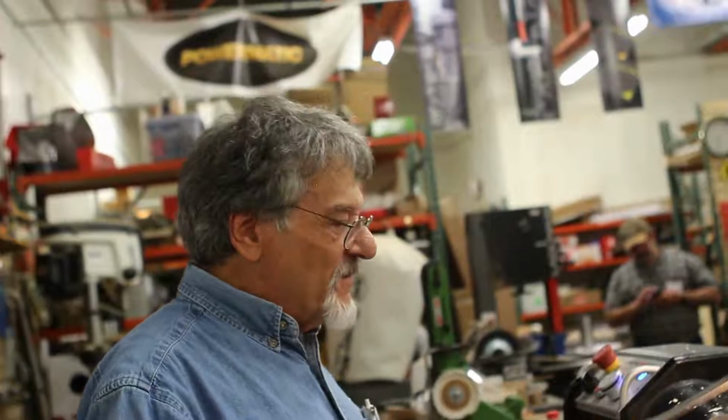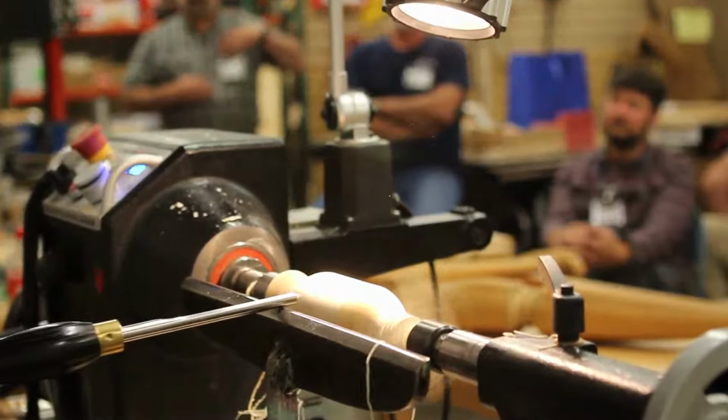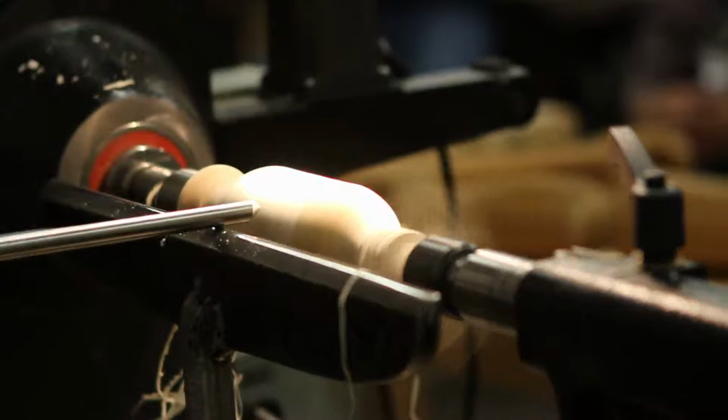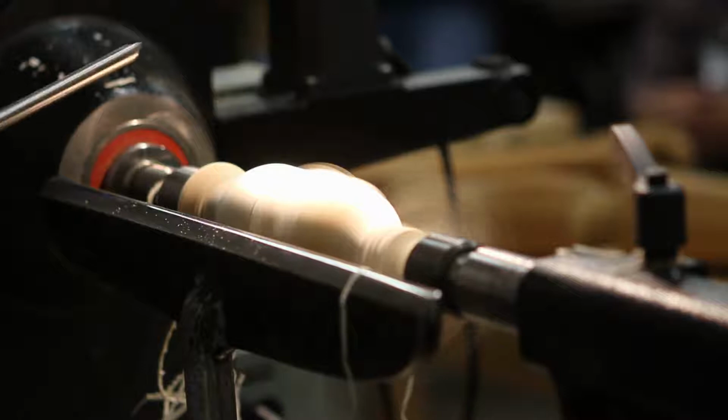But let's look at this situation with a gouge going straight into a piece of wood. If I'm standing back here, now I'm not imparting any sideways control on the chisel because I'm holding it back here. If I have the chisel straight up and I push it in, it is stable because it's cutting equally on both sides. If I tilt it to the right and push it in, it goes to the right. And if I tilt it to the left and go in, it goes to the left. So you may conclude from that that there really is only one stable position for the chisel, and that would be straight up, but that's wrong.